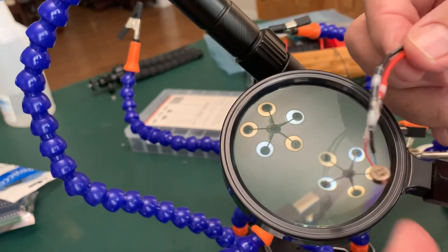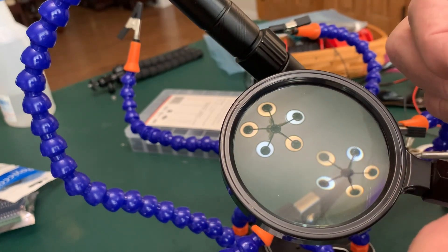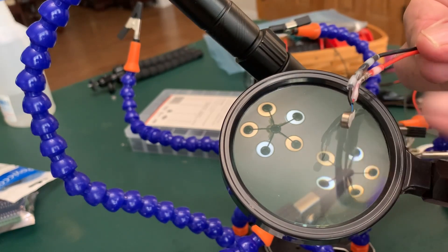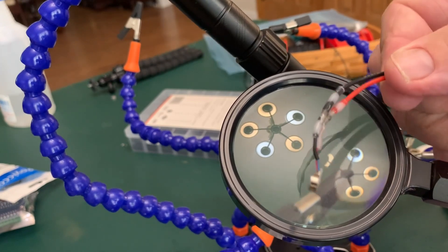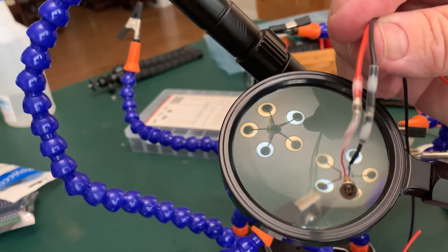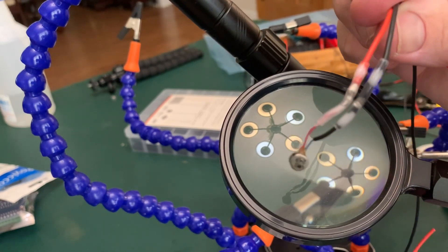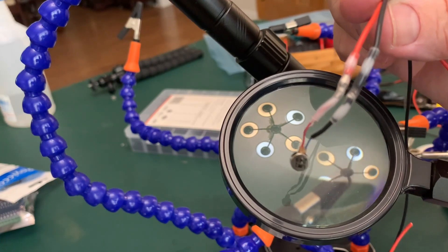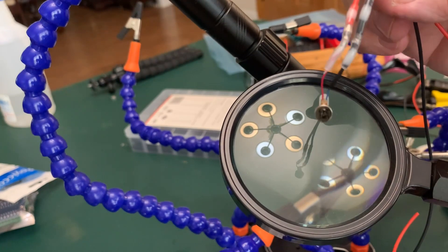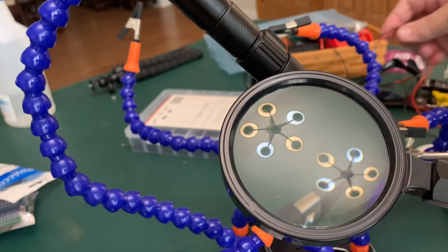There is another one complete and heat shrunk down. In this case the red wire did not get that extra piece of heat shrink, but it appears to have a pretty good mechanical hold — I made sure I really got a good melt on that plastic. As I said earlier, I'm going to continue to solder personally — I like soldering and I think it's a better joint — but certainly these connectors are a solid tool and give a good mechanical connection. The next thing I'll show is putting one together with the Amazon motor; the only difference is you'll need an extra piece of heat shrink to build it up because the motor head is larger.